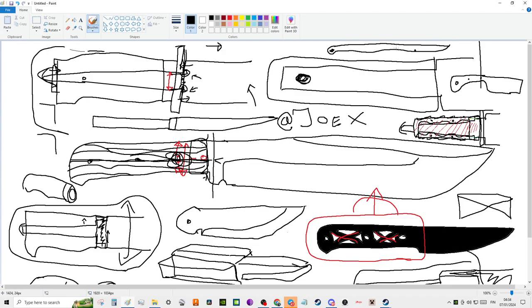that's as strong as possible, you're not gonna have scales on this. You're not gonna put pinholes in here, because at this point, immediately when you put a pinhole here at the front, it's gonna break. There's very, very little material in that front pinhole to offer a really, really strong blade. Because it's so thin, because there's so little material on the scalpel, using scales with pins is not advisable because you're going to substantially reduce the strength of the blade.